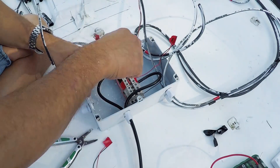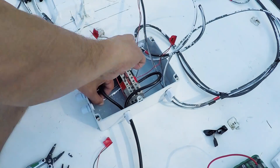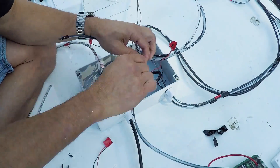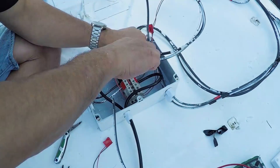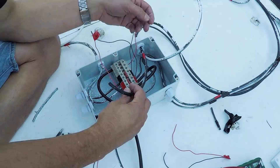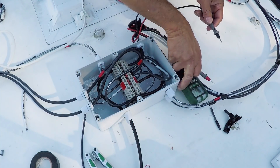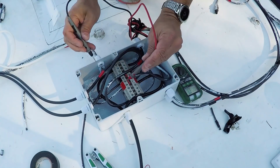With the box in place, I got rid of all those extra connectors, adapters, and extra cable connections, and ran new cable where needed from the individual solar panels back to the box, running them through the cable glands into the appropriate spots. From there I was able to make all of my connections for my two solar arrays, wiring everything whether in series or parallel directly inside the box, and got it all wired up to the correct outputs.